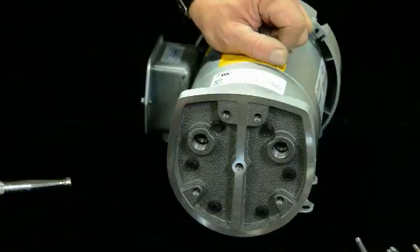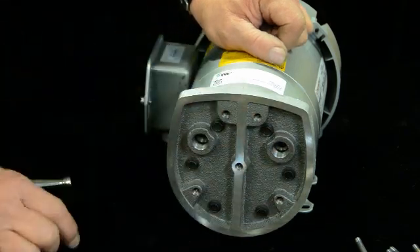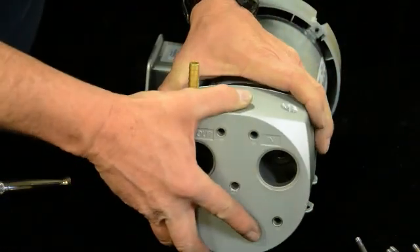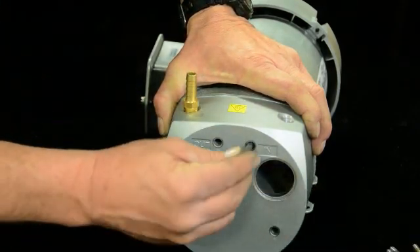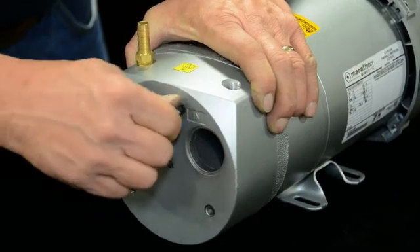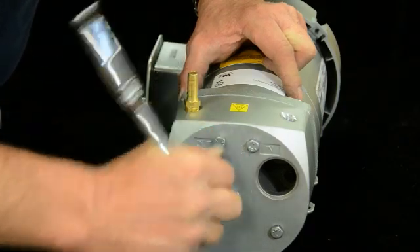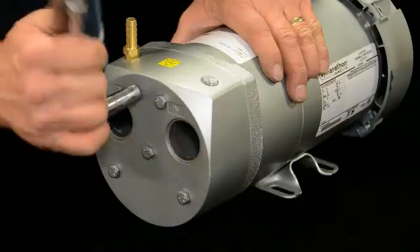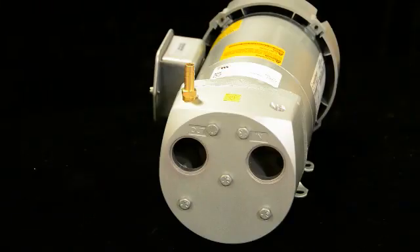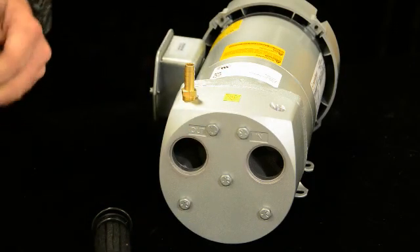The back of these bolt heads are locking bolt heads, so when you tighten them up they'll stay tight. I feel comfortable that we did a good job — it stopped good, started good. We'll go ahead and put the muffler side on now. We've changed the gasket — they come in the kit — and we'll just get these bolts tightened up and torqued the same way.